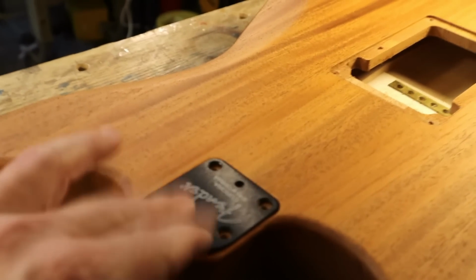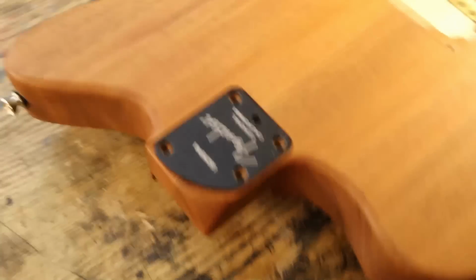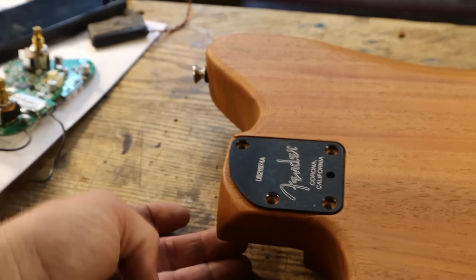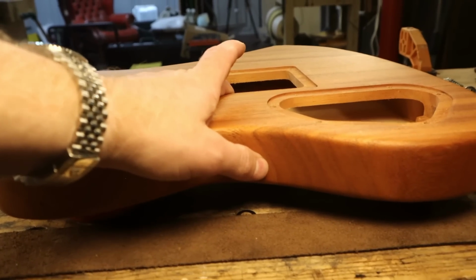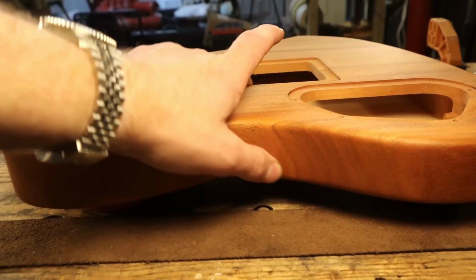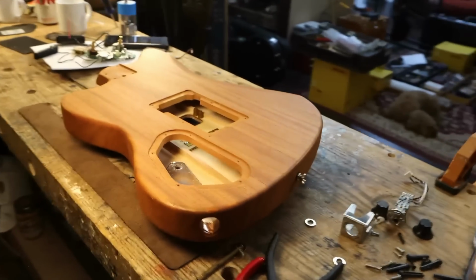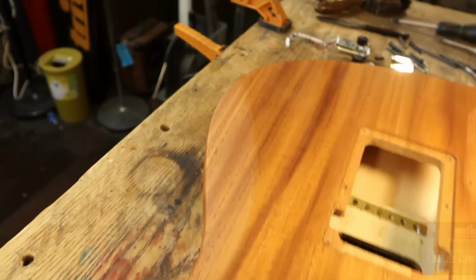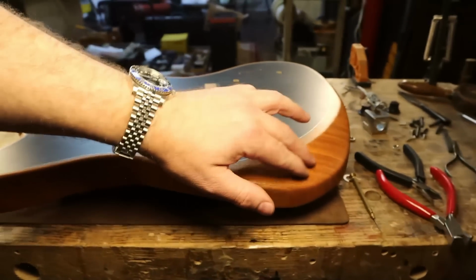You want something that feels nice and flush and beautiful, but also you need play. You need to have a little bit of space around it to move. You want to have this comfortable thing, and it's comfortable. I can feel ridges there in particular, where you've got the hard grain where my finger is and the softer grain in between, and when it was sanded, it's left a bump where the hard grain sanded slower than the grain on either side of it. If they'd spent more time on things like that, then the guitar would have been two, three, four times the price. The finish here is the same finish that we use for our students in the Crimson Guitars School of Luthiery. A very quick drying, open pore polyurethane varnish.